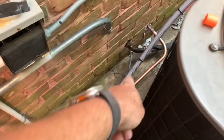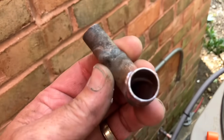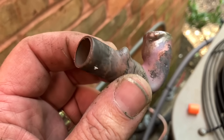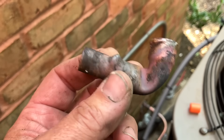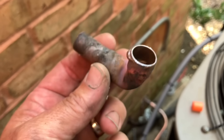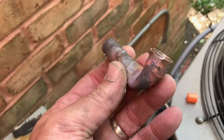So I'm probably gonna have to cut that back and put a coupling or a swage there. Here was that 90 — crazy, this has been running for years with that nice big restriction right there. Probably added about 30 equivalent feet to the line set because of that kink. Crazy.